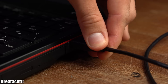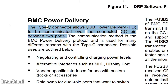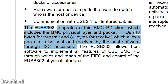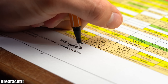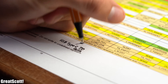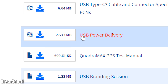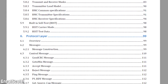After hooking the Arduino up to my computer and connecting the USB Type-C PD power bank, it was time to write a bit of code. According to the datasheet, the FUSB302 supports USB Power Delivery communicated over the connected CC pins, and it integrates a BMC PD physical layer with its FIFO register. This sounds complicated at first, but what we simply have to do is send the correct USB Type-C PD voltage data to this register and it does the rest. Finding out what data to send, however, was much harder — downloading the latest USB PD specifications from usb.org gives a PDF file with over 600 pages.